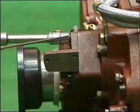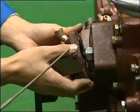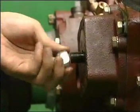Release the four bolts in the air cylinder back cover. Remove the cylinder back cover and release the self-locking bolt in the rear of the piston. Take out the cylinder piston and o-ring.